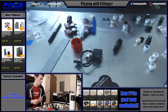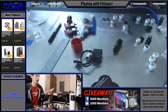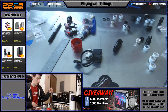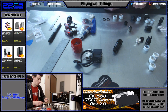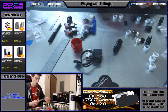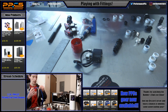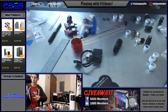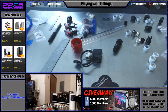So what I was figuring, I don't know if anybody's ever actually done it, but I'd almost just fill your piece of PETG with sand and then do it. Cap off the ends. You could just use a G-quarter, I guess, and then cap it off with a female-to-female and fill it with sand and then bend it. The sand will act like your insert, and then when you're done, all you've got to do is dump out the sand and you're good to go. Because the insert, if you ever tried to make any sort of tight coil, the coil that I made wasn't even entirely too tight, and it was only two times around, and that insert did not even budge. So, it's kind of tough.